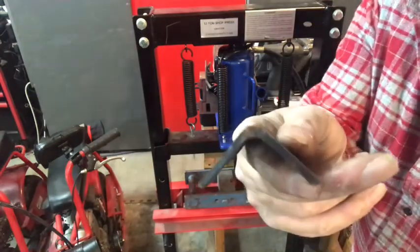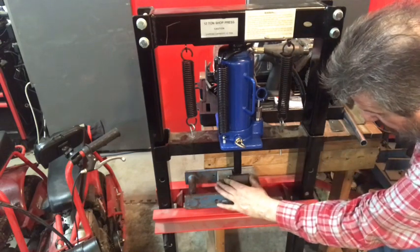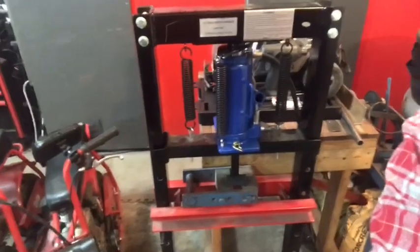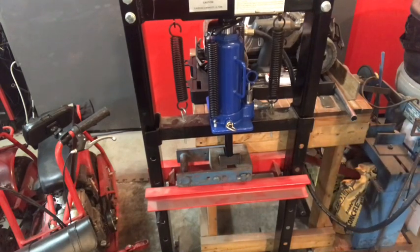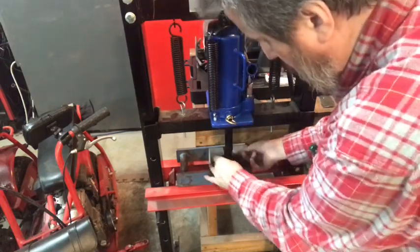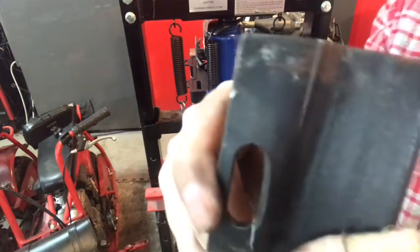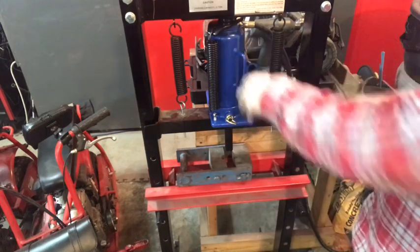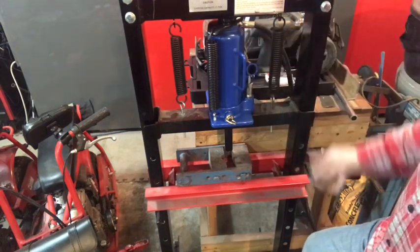I'll take a piece of angle iron here — this is tough old bed frame angle iron, horrible stuff. No problem whatsoever — squish that down like nothing. You can see it's starting to split right there. Bed frame angle iron in general doesn't bend very well. It's a beast. The jack was $129 on sale — I think they're regularly $159. Even at $159 I would have bought it. It just makes using the press so much easier. You want to use it more when you don't have to crank it up by hand with a handle.